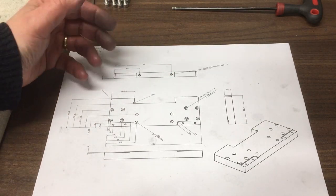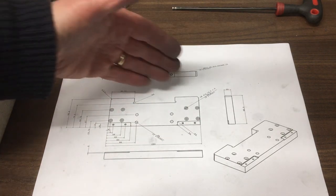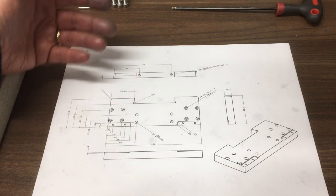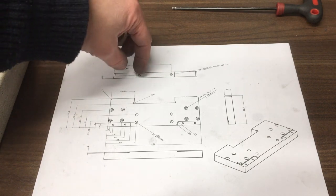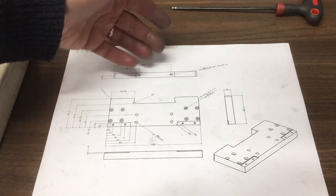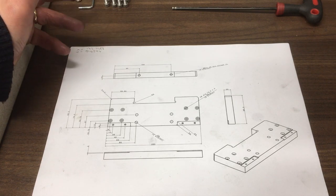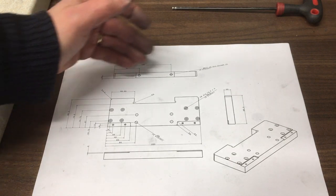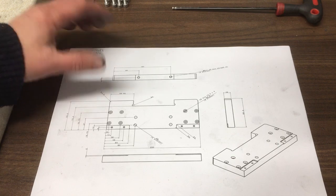The reason for that was I've kind of got the CNC machine set up for big plate work, and I've got another piece to cut out. In fact, it's the piece that goes in here, and I would have to break that setup down and then put the vice in, pick up off these edges, drill these holes to get it really accurate. And I thought, well, this is why I built this drilling machine. The idea is that you should be able to just pick up off a couple of edges and drill a hole in a reasonably precision location.